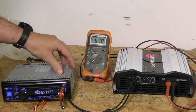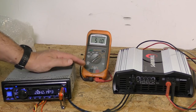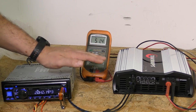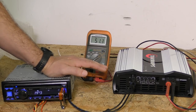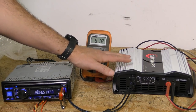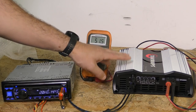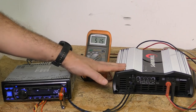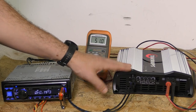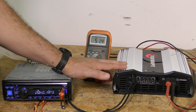That's 8% less power that you're getting at lower frequencies. The whole reason this test came about is because a customer told me they swapped amps to a full bridge and it didn't play as low as well. I have seen other amps that have a much larger variance — some are showing as much as 30 to 50% less power at lower frequencies. So this one's on the better side of things. Where we saw more power out of the half-bridge amp, on the full-bridge amp we're seeing 8% less. When you go below 20 Hz, you see even less, closer to 20% difference, even though it says frequency response is down to 10 Hz.